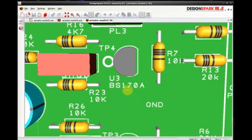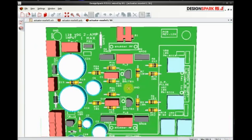They're basically baby MOSFETs, you know. So they're going to drive the positive MOSFETs, which there's 2 of those. So there's the NMOS, there's another NMOS. Sorry, that's a PMOS. So when that NMOS is on, this PMOS is on, and this PMOS is turned on by this MOSFET here. It's alternatively turned on by pulses, with a dead zone. That's a dead time in between each pulse.